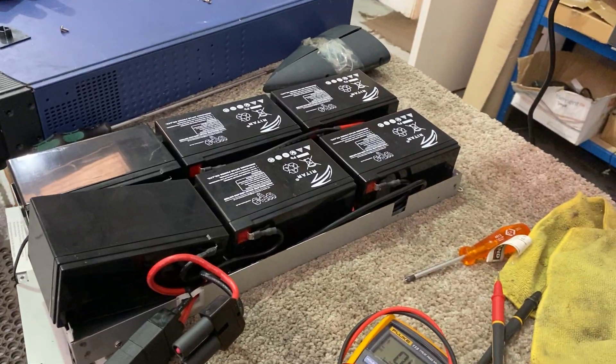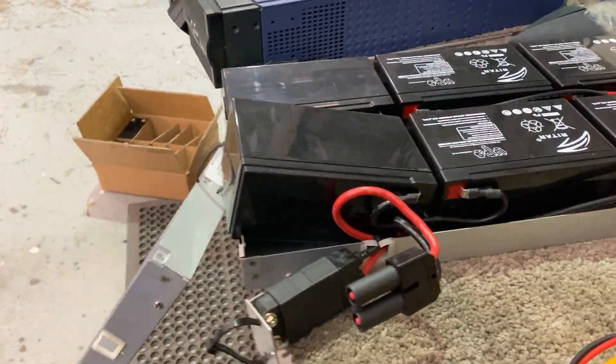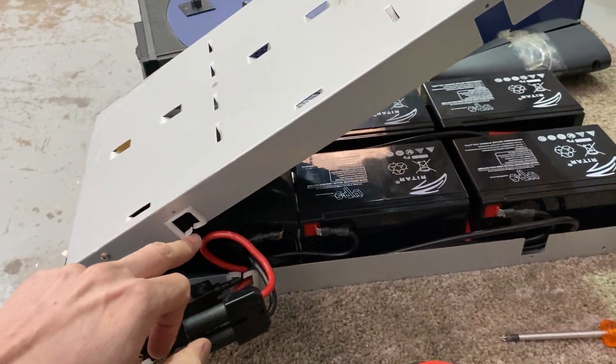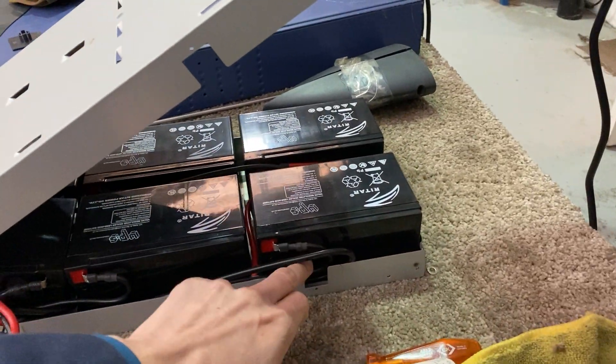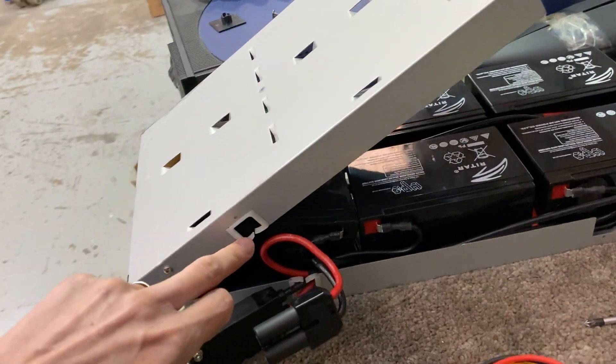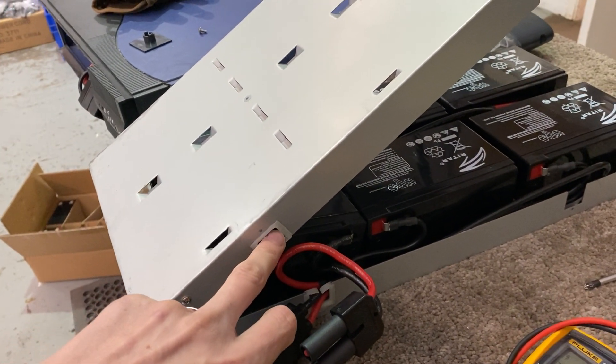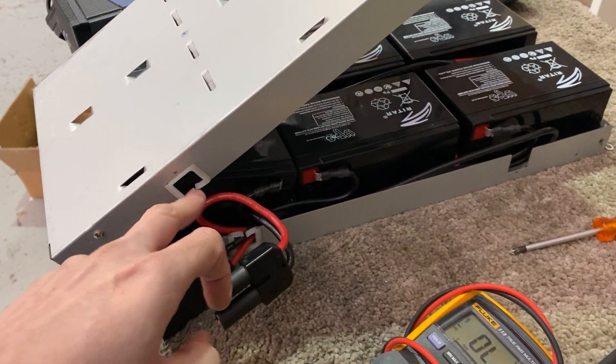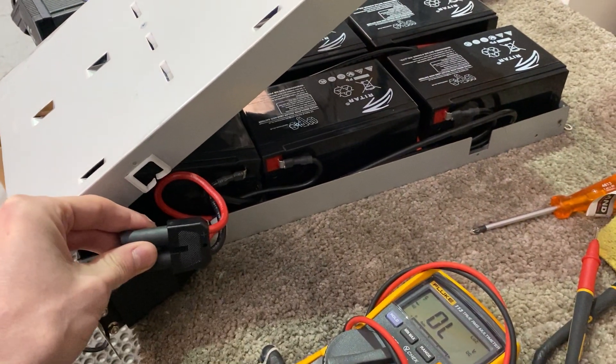The case is symmetrically stamped, so the top is the same as the bottom. Both cables come out the front — sometimes people try to have a cable come out the back, but that's wrong. There's a small protector sheath so that the case, which is a stamped frame, can't cut the cable. I generally have one going through the bottom and one going through the top.